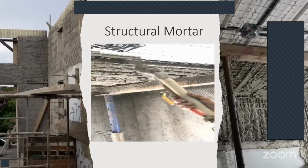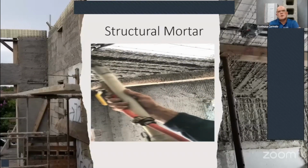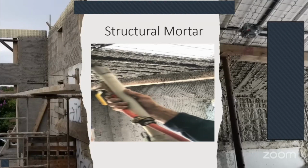Right. So if you've got those plastic pipes in there, why wouldn't you use that to finish, just the structural mortar, as a guide for that 3/4 inch? And then you take them out. You have to take them out. I realize that as well. But couldn't you just finish the concrete to that level with the plastic pipe? Do you need to put another coat on after that? The problem with the structural mortar is, we try to make this material cheap, where it has a lot of cement and also has fibers, but some plastic shrinkage or cracking will appear there, and that's why you want to cover it either with the synthetic stucco or a thin layer of finishing mortar, which is the type N.